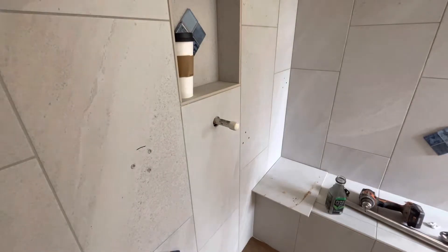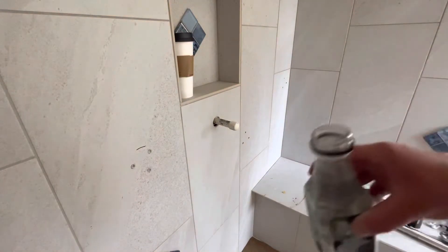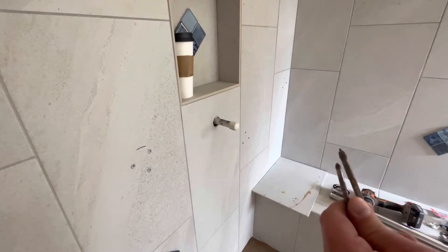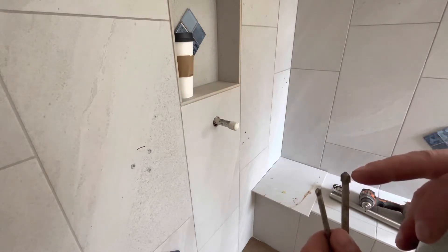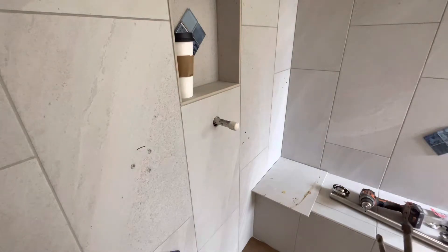But those take a while and burn out really quick, so if you are using these it's gonna take you a lot longer and you want to keep dipping it in water. Drill for about 10 seconds, no more, then dip it in water. These things can actually get hot enough to break off in your hole and then you have to use a metal bit to drill through.